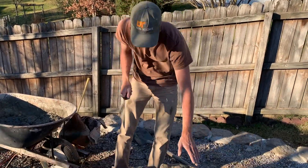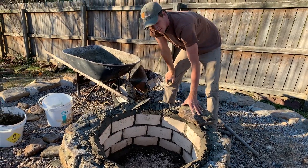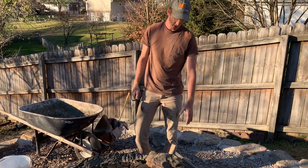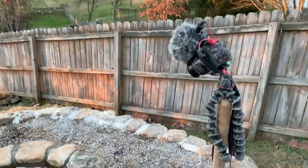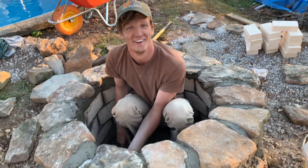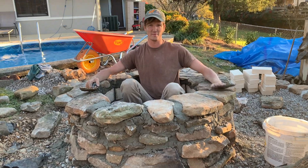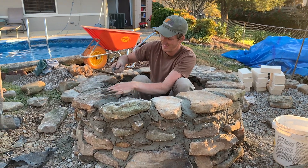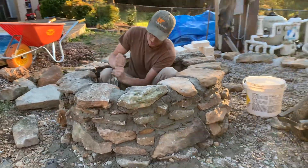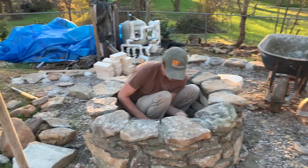Last step here — we're going along the top with our capstone, making sure to settle them down. These are the flatter, bigger stones that will be the last little step, so that when people put their foot up on here or sit on there, we don't worry about them being wobbly. My camera died so Ashton is letting me borrow his phone — hopefully the audio is okay. We're happy about this fire pit, it's looking good. I'd say, what do you think Ashton? He said it looks pretty spectacular — and when I asked him on a scale of one to ten he said fifty, so that's pretty awesome.